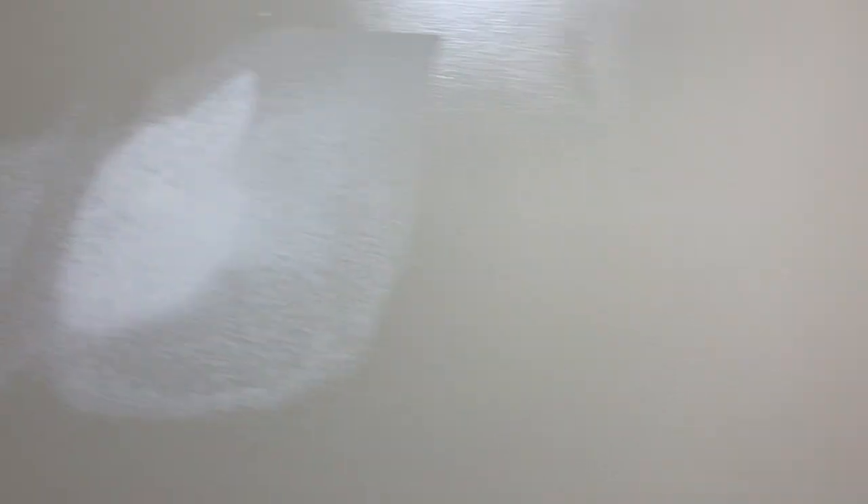This is what your mud should look like — nice and smooth. That hasn't been sanded. If you have built-up edges, you're putting the mud on too heavy. Put it on and take it off at about a 45-degree angle. There should be no built-up edge to have to sand. Here's when it's all finished — hasn't been sanded.